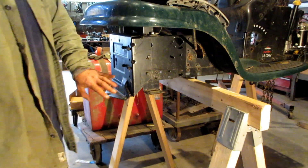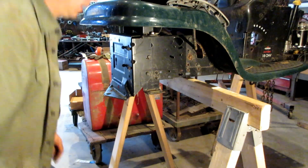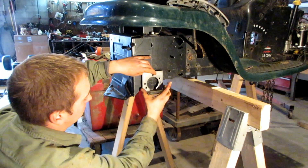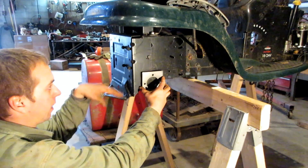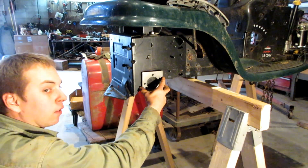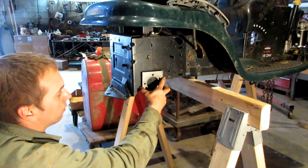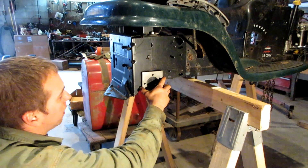We're back here looking at the back of the racing lawn mower and I kind of lucked out. It turns out that if I leave this bracket here and place my bearing plate right on top of it, I could sort of eyeball the middle of this bracket. It actually puts me about exactly where I want it to be. It ends up raising the back of the mower about another quarter of an inch, but that will give me more wiggle room in terms of ground clearance, so I can make sure if I ever actually enter a sanctioned race that it will pass tech.